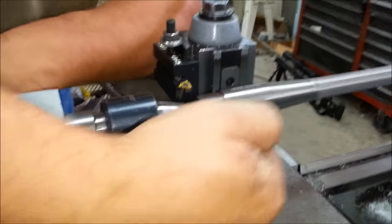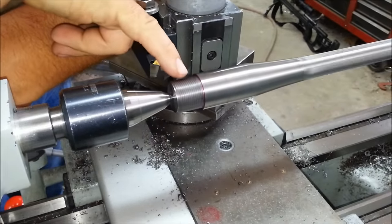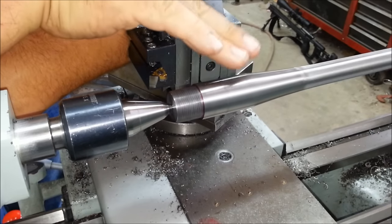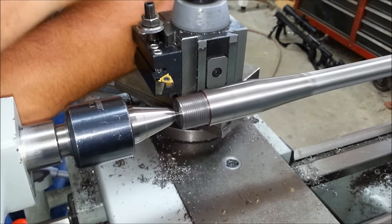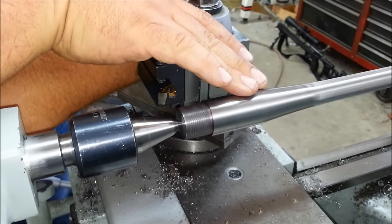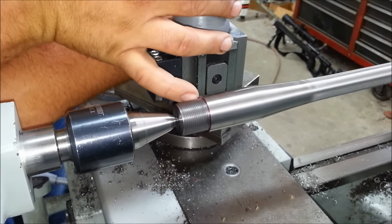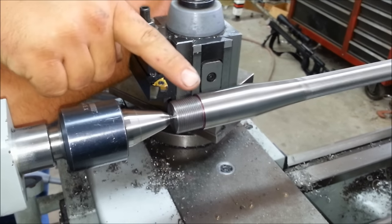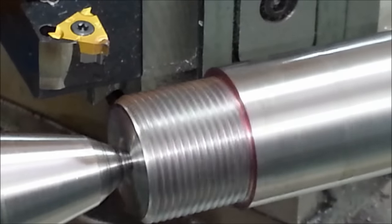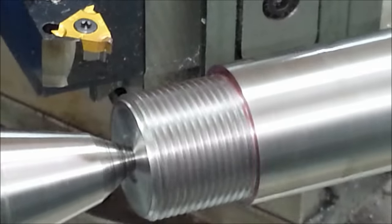Okay, I've got the shank threaded to where the receiver will just barely thread on. I'm going to polish the sides of the flanks of the thread and the tops of the threads. This is going to loosen up in the receiver just a little bit, but then again, this is a stainless barrel on a stainless action. The last thing I want to do is gall the barrel into the action because my threads are so doggone tight. Again, we want this shoulder here that we mentioned earlier on the front to be in contact with the recoil lug squarely and evenly. So if the threads are just a touch loose, I'm not saying like a hardware nut, but just a touch loose, it'll actually be a good thing in this situation.